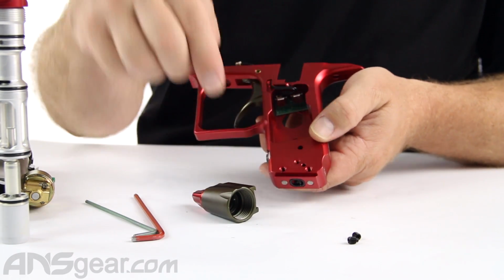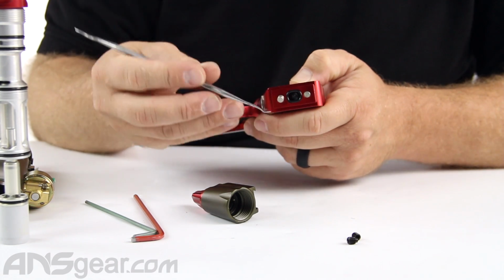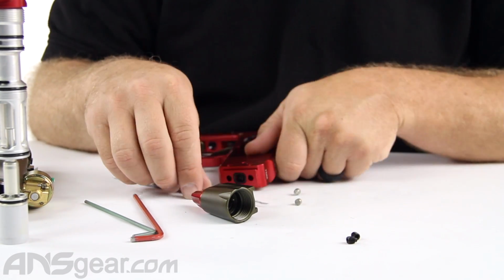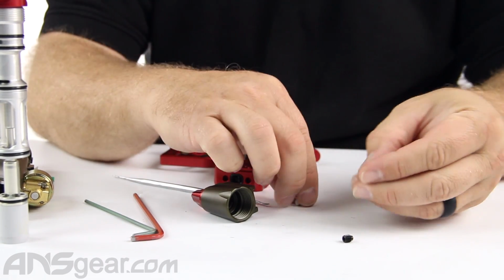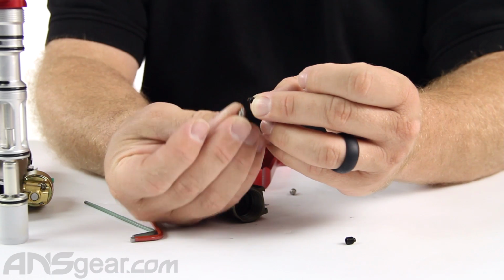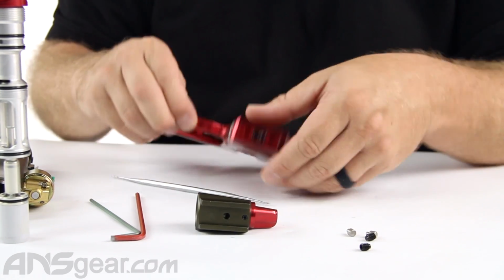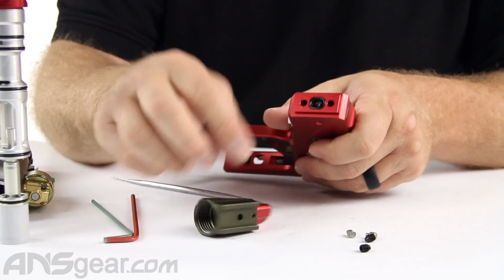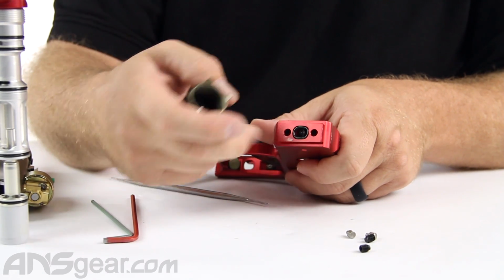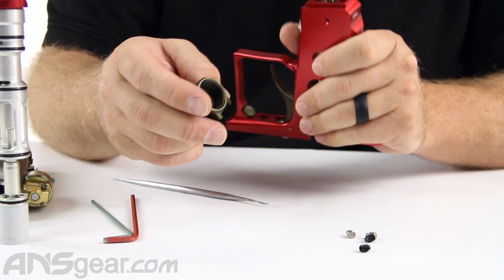When they go in, they actually push on 2 pieces, and they cause them to push down. So this screw comes in, rides against this screw, pushes it down, and that's what locks the ASA in place and keeps it from sliding around inside there. There's a gasket right here. You can see it sitting right there. So if you ever get a leak from this area down here, check this seal right here and make sure that the seal is good.